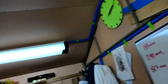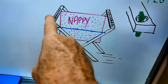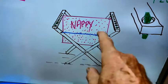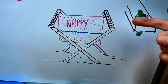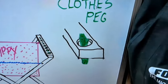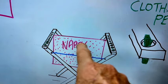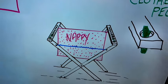I've done a drawing on the board here. What you have is basically two crisscross slats on either end, and then two horizontal bars each with a series of holes in them, and into each hole is a clothes peg which is held by a nail through its middle. So you've got a whole lot of clothes pegs down the side. The pegs hang and there's a nail that goes through the middle of the peg. You can pin nappies up right across — in this one you can get 18 or 19 nappies if you're using cloth nappies.